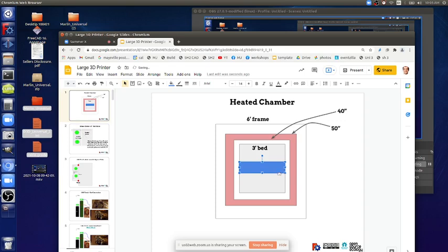So that's our cool area here, but what that would mean is we might as well cover the entire top. To get anything to work here, the first step is mounting that shroud underneath the extruder so you have this thing riding on top. So the concept is you have a shield attached to the bottom of the extruder with only the nozzle sticking out. So you mount it to the underside of the carriage, the other side of the carriage, underside of it. Or even cut out a hole for the carriage so that the whole thing can sit in there.